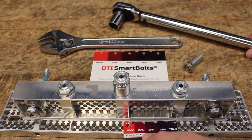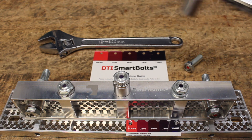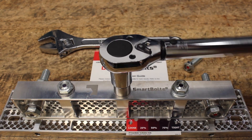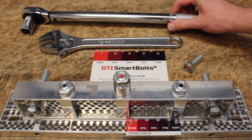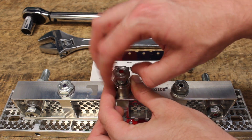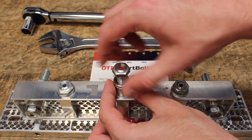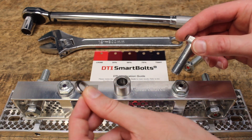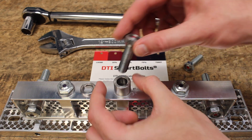This M12 has been calibrated to target the tension or clamp force that the torque value was designed to meet, but torque and tension are not the same. The amount of tension from a given torque can be highly variable. There are many factors that affect these results, like friction, cross threads, or damaged or mismatched components.